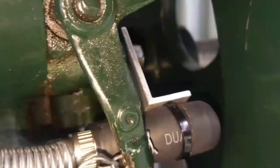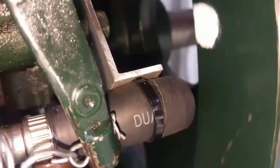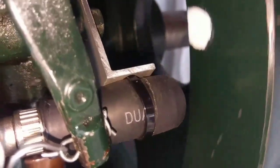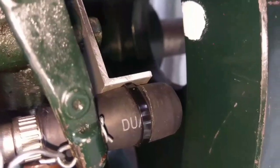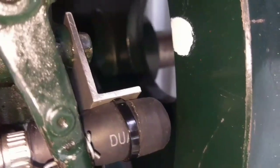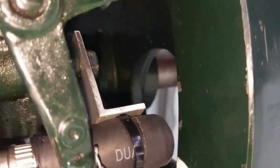And then I've got this infrared detector, and the infrared detector detects dots as they go past. I've got four on the flywheel — it just counts them. Four dots equals one revolution. The Arduino does the maths, adjusts the fuel rack, and I get nice accurate frequency output from the generator.